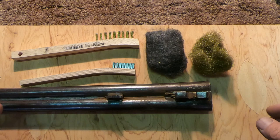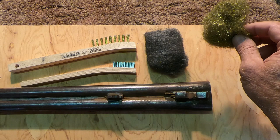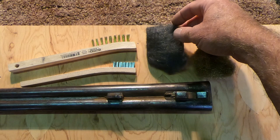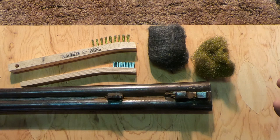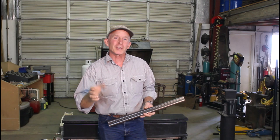For the places that are really hard to reach with a carding wheel, you can use this carding brush, which has the same kind of really fine bristles as the wheel. Brass or bronze wool is really good, or with a light hand, a real fine 4-aught steel wool — just make sure and degrease any of these things before you use them. You can use these products to card the whole thing if you'd like, but it just takes a long time; the carding wheel makes it a much faster process.